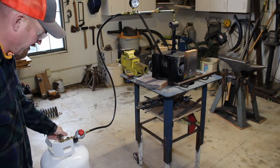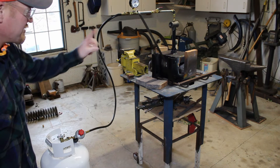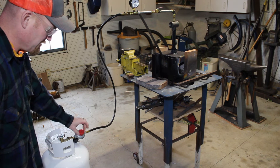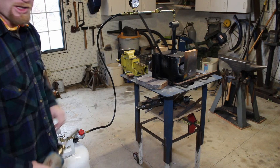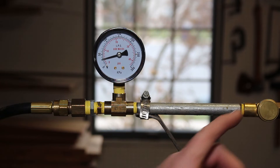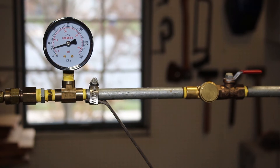For the firing sequence, I'm going to turn the tank on first and open up the valves from the tank to the burner. I have this valve, then the high-pressure valve that opens in the opposite direction, and I open that until I can read the pressure on my gauge. I like to have somewhere around five PSI on the gauge to start up and fire it. Once I know I have pressure, the last thing I do is open up the needle valve, get ready with my propane torch, and when I hear the gas flowing, that's when I light it.